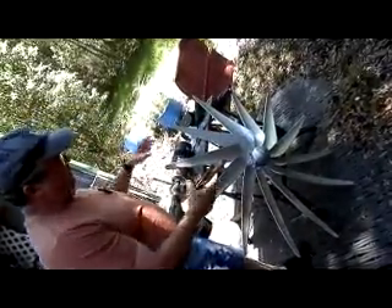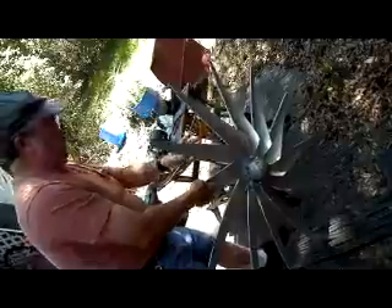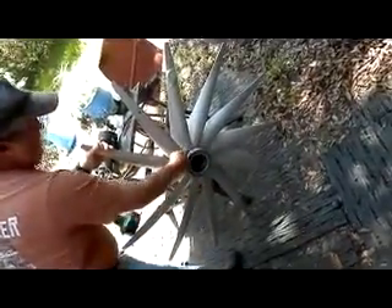I'm going to start talking about this one that I made last year. It was up on a pole and serving me, but I've got two other windmills up on poles right now testing them. This one is made out of PVC pipe — schedule 40, 6-inch pipe — that I cut in half, then into quarters, and then cut them diagonal. That's shown on some of my other videos. This is a toilet bobber I cut for a windbreak in there, and it's set on a hub that came off a treadmill motor. Here is the treadmill motor I was using — it's a 2.9 horsepower DC permanent magnet motor, and when it spins around it makes electricity.